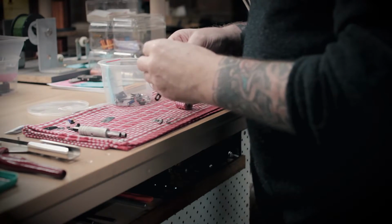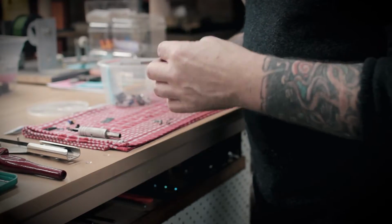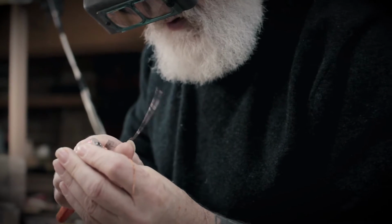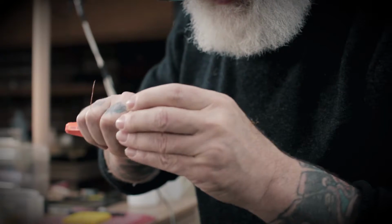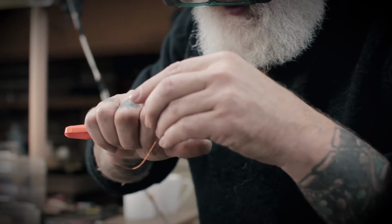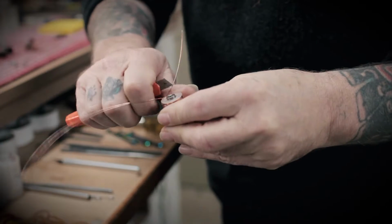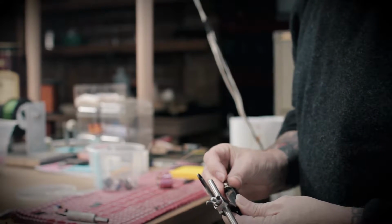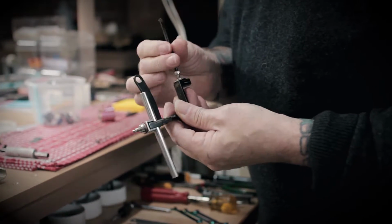The coils have a coating on the wire that needs to be removed where you're going to solder them to lugs or other elements. You have a top and a bottom coil. Colin's already established which one is which and prepares his wires by scraping the shellac covering off the wire. Because Colin is building the machine how he used to, he's chosen to use a supplier that he used in the old days. The reality is, he can make his own coils, but he can't get the power and quality of punch out of handmade coils than he would from these particular ones. The supplier still makes the same coils in the same way as they would have done 30 years ago, and it's the same quality as if they were from back then also.